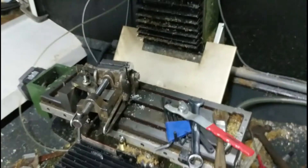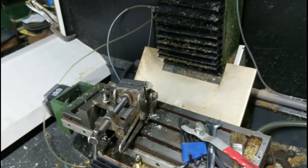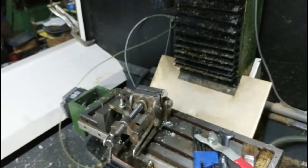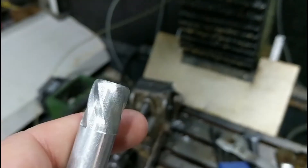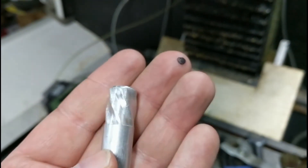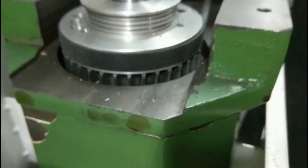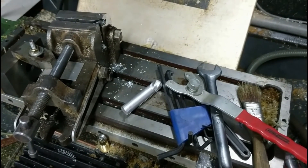I thought I'd start doing a little more of the making-of-the-sausage videos. In my previous video I've been doing polygon boring and polygon turning with this little green machine. If you look at this, you can see those vertical lines — that is the resolution of the spindle encoder, this gear tooth encoder I'm using. It works perfectly fine for why I put it in there, but it doesn't work very well for doing really accurate spindle positioning for the polygon boring.